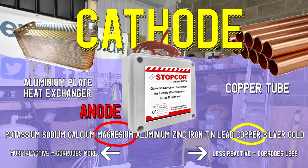So why do we call what's inside the Stopcor a sacrificial anode? Because over time, it releases all of those electrons, and a Stopcor will take about 3 years to do that. So that's how we use a sacrificial anode like magnesium to make that the most active metal on the system, therefore protecting all the less active metals that we can find on the system itself. So the product does two things, and a little extra thing as well, which we'll come to in a sec. It stops corrosion in your heating system and also prevents limescale by imposing a 1.5 volt protective electric current throughout the whole system. It also does a little extra.